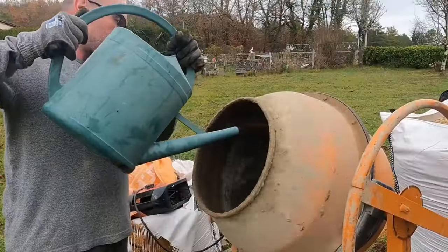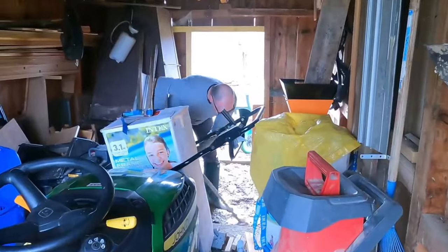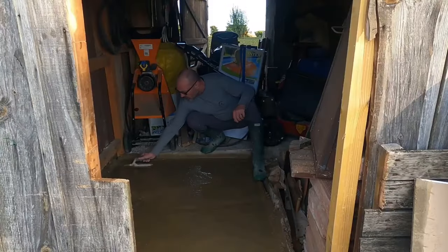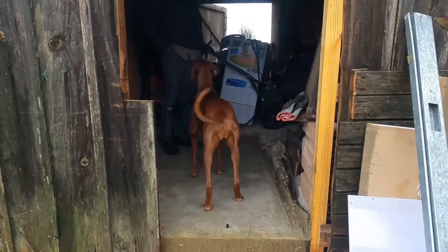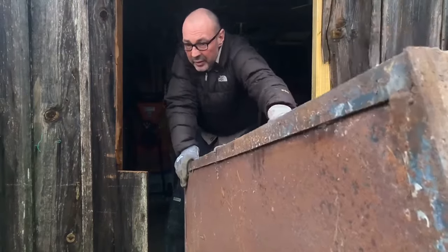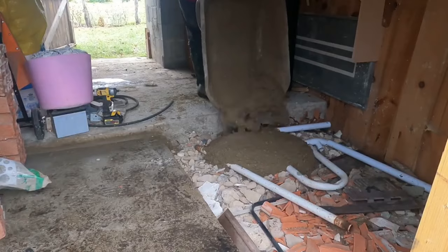All the accumulated builder's waste was spread evenly around the floor to create a base to concrete on. The base was cast in two parts, and I really wish I'd paid this much attention to the higher floor at the front of the barn. Those areas were cast in piecemeal fashion when we had spare concrete from other projects going on around the house renovation. To cast the second part of the slab I first needed to remove the old wood burner that had become redundant. When I looked at it after all those years of storage it was damaged and wasn't really worth the space.